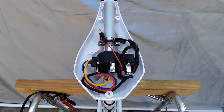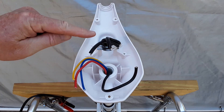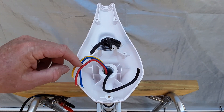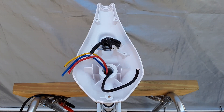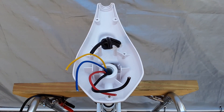You can pull out the handle, and once you've clipped the wiring the switch will come right out. After removing the handle and switch, what you have left is your two battery power wires and four wires coming out of the shaft — negative, positive, and then a blue and a yellow which you're not going to use. These are pretty standard for a five forward, three reverse speed selector switch in trolling motors. All you're going to need for this project is the positive and negative going into the shaft.